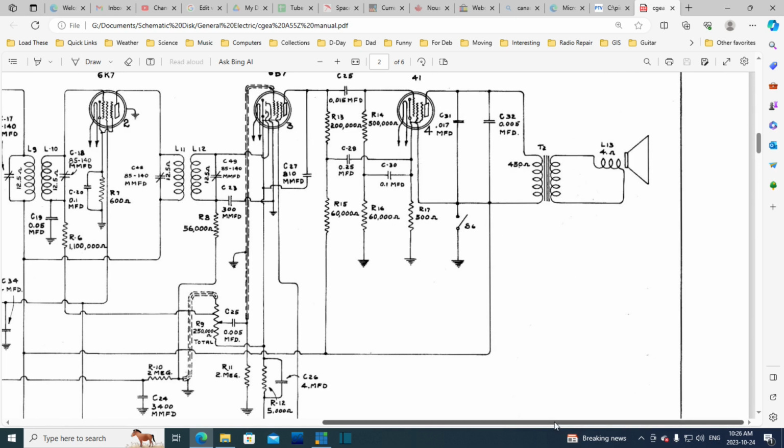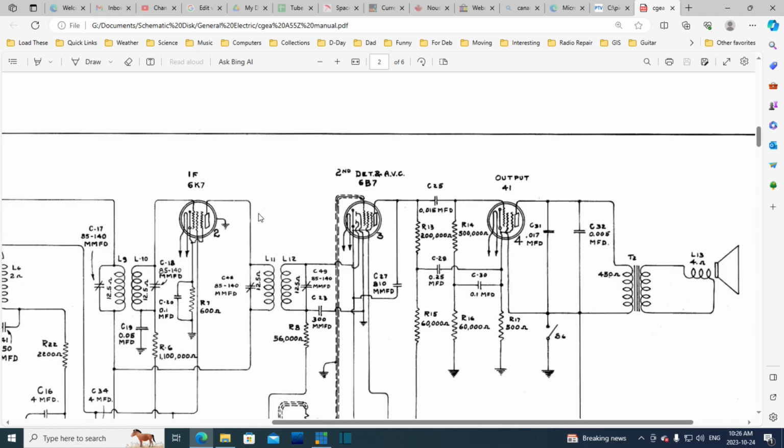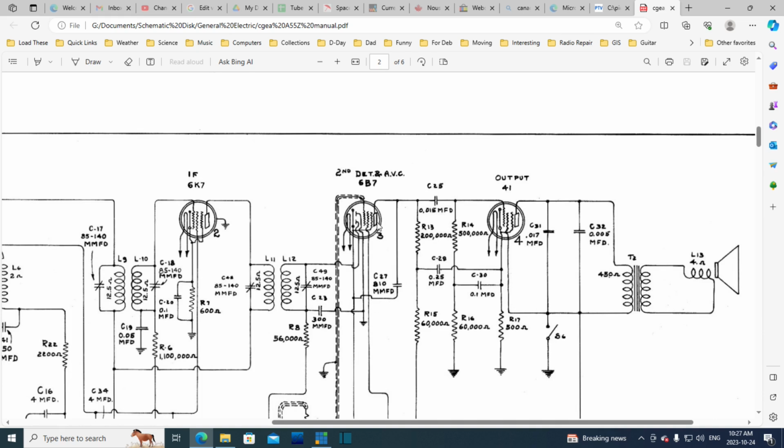Okay, so we've gone all the way through here. I'm just going to do it kind of blocky rather than so specific. So signal captured here, signal mixed with the local oscillator that's generated down here. Out of it comes a potential component at 460 kilocycles. There's always a 460 kilocycle, but not necessarily a station there, because you haven't tuned the radio to a station. So out comes the IF signal here, gets through the transformer, gets amplified, goes through another transformer, detected with these diodes, down through the volume control, back up, out through the triode here that's providing enough voltage swing to operate the output tube, and output tube powering the speaker.